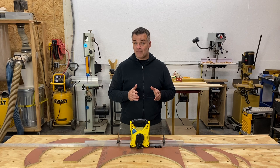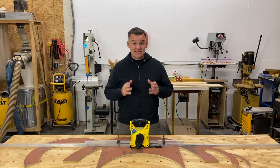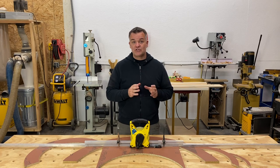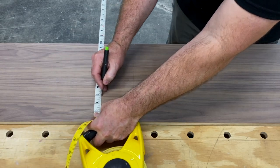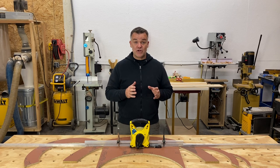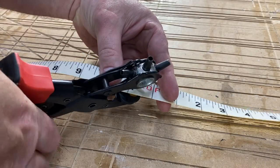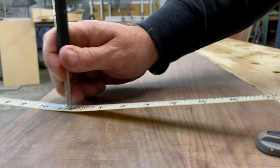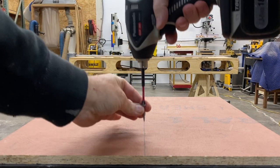That makes my measurement nine feet eleven and five sixteenths of an inch. Because this tape only uses eighth-inch marks, I like to use my ruler to get the exact point. Now, how do we use the tape in the most accurate way to draw the arch? Placing your pencil in front of the tape and trying to draw an even arch — especially a large arch — usually doesn't end very well. Here's a trick: I use a hole punch to punch out a hole in the center of the tape that is the same diameter as my pencil. Now I can get a perfect arch.